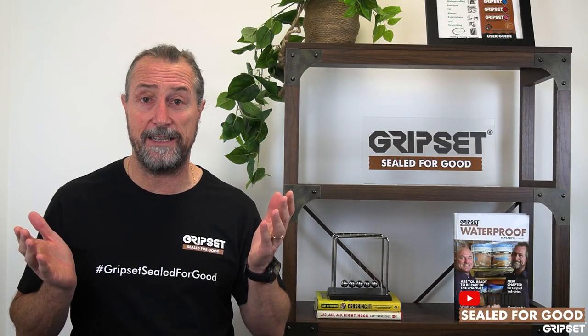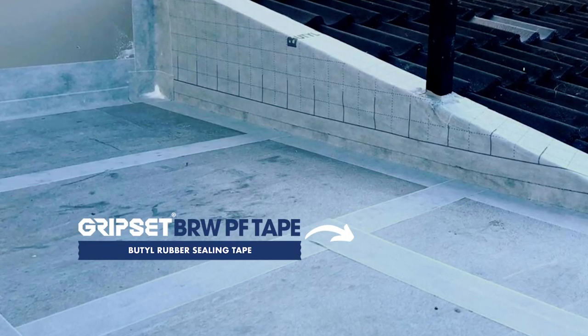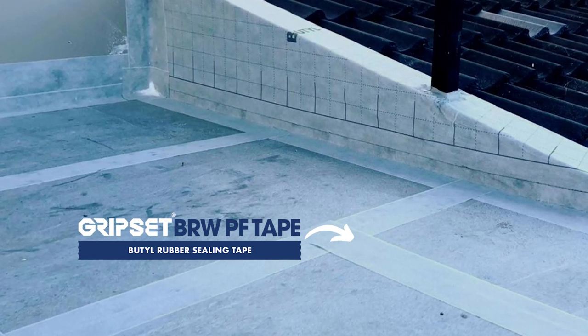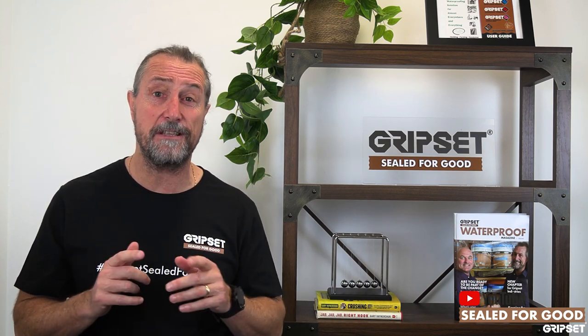Once you get the primer down on a surface that's been correctly prepared, we go into the detailing section. Detailing on balconies is far more critical than on internal wet areas, and I find detailing critical in internal wet areas all the time. So if I'm saying it's more important externally, this is the part where you do not take any risks. Look at those joints, those junctions.